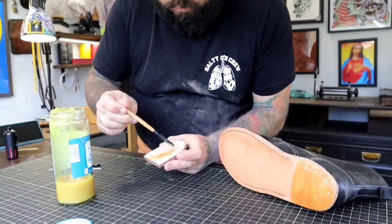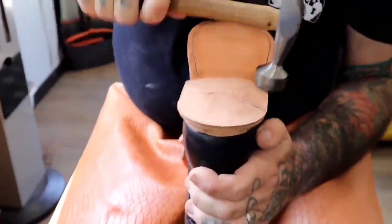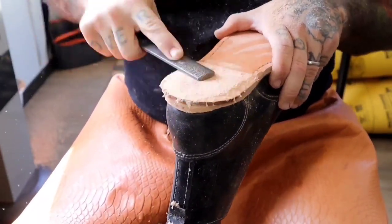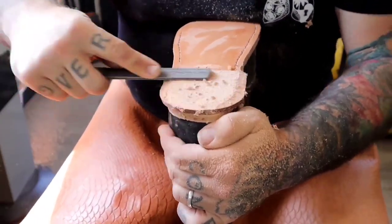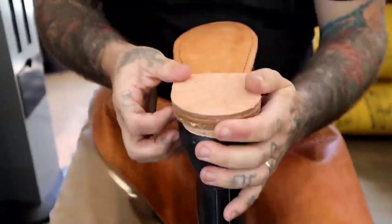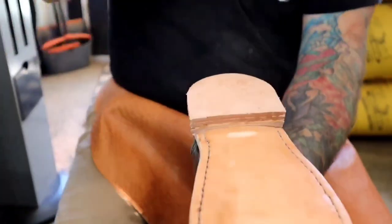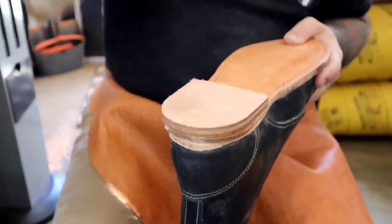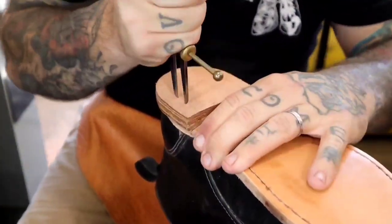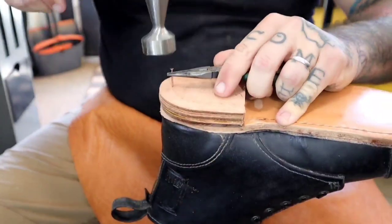Here's another mistake I've made so you don't have to: be sure to flatten each layer of your heel block. If you don't, your heel will feel like a rocking chair. Take the time in this process, place the boot on a flat surface and check your progress — it's worth the time. Here come the wing dividers again. I've tried to shortcut these things before and just eyeball them, but the time you save is only about an eighth of the time you'll spend fixing it. Try to avoid shortcuts if you want to save time.